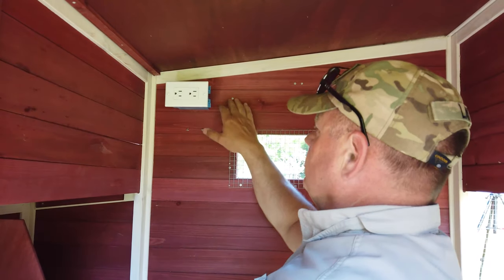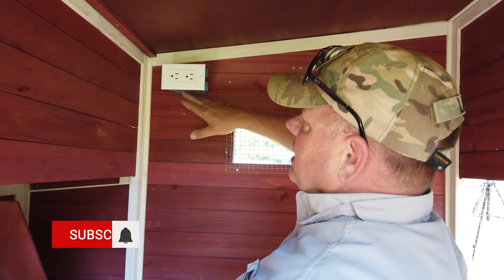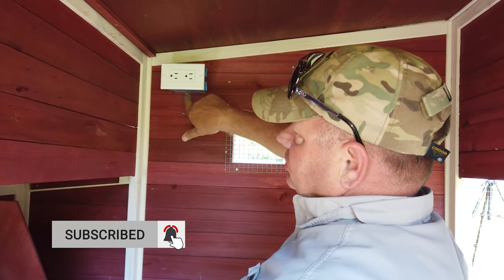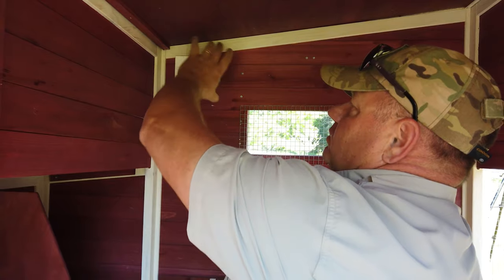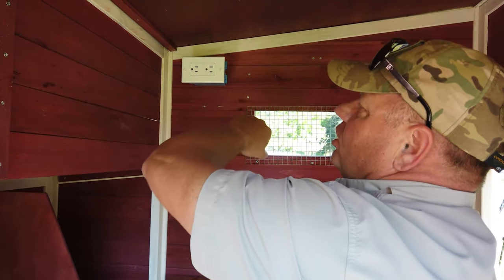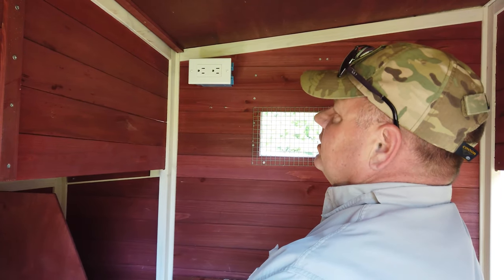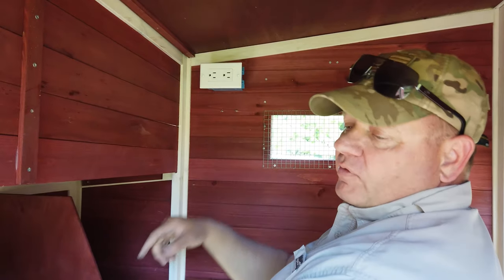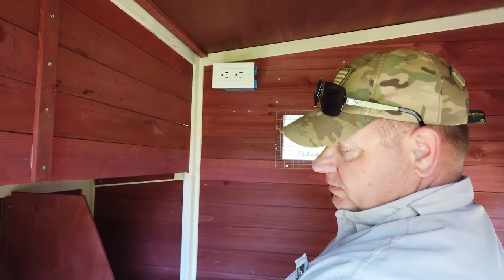All right. It's a non-traditional way of mounting it, but because this wall is so thin, I just drilled two holes in the bottom of this box, and then drilled a 3/4 inch hole and put glue around it. Now I put the box over the collar that comes through the wall, so that'll be a waterproof connection. It's not going to be water in here anyway, but I just wanted to be better than not. Like I said, this line is coming off of the shop, and the shop has ground fault circuit breakers.